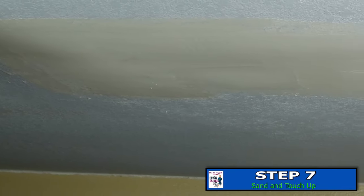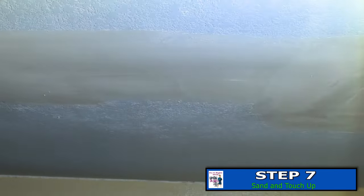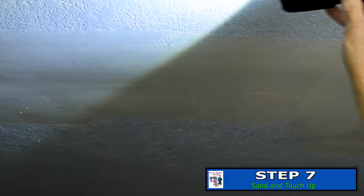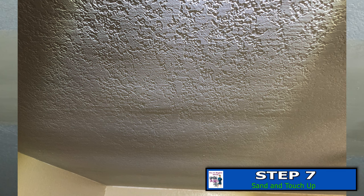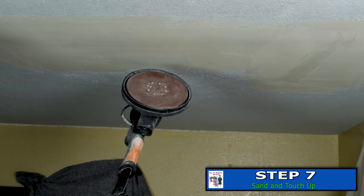If you're having a hard time seeing defects, here's what you can do: get a bright light like this flashlight and shine it across the surface. You can see even the humps in the ceiling — this whole ceiling is wavy, which happens a lot especially when houses are built with artificial heat, wide spacing, and half-inch sheetrock. If you can't see it, it's not real important. But as soon as you light it like this it makes every defect show. We're just looking to see how bad it is right now.